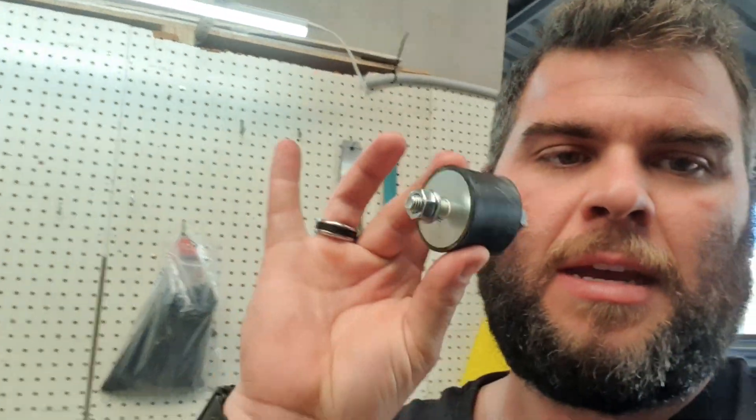Back in the shed again with a new bottle of gas, been laying down some welds on the frame. Finished welding out what I had started before I ran out of gas. We got them all TIG'd in nice and beautiful. All finished up welded now. We need to get on to making some little angle brackets to mount these little bad boys in the corners, because the engine plate and compressor are going to float on rubber bushings separate to the actual tank frame.